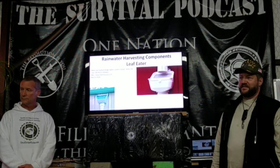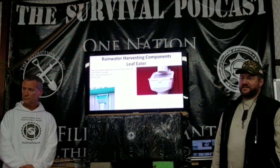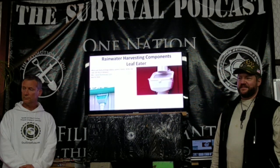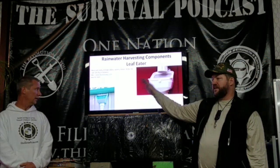So you just tack it up there, and you basically cut a hole in your gutter, like about 4 inches by 8 inches. So instead of having that little hole, whether it's the 2x3 or the 4-inch, it just opens it up. Now, I don't care if leaves go down. Yeah, and for us, it's going to hit these leaf guards and it's going to shed right off.